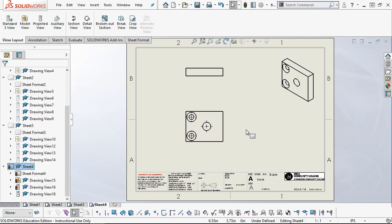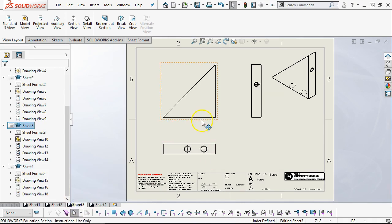All right, so things to look for as we go through the stack up is almost everything up to this point is going to have some kind of form tolerance, flatness, parallelism, at the very least, flatness on the bottom, and then a positional location to the bushing. And then let's see, if we looked at this one, we talked about the angles. We'll need some perpendicularity in there, some way to control that, probably a flatness on the base.